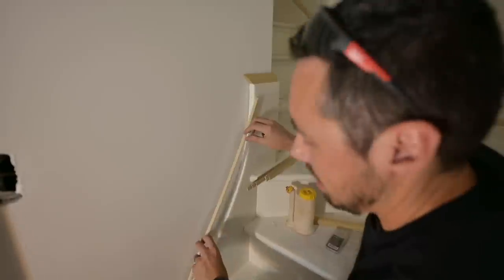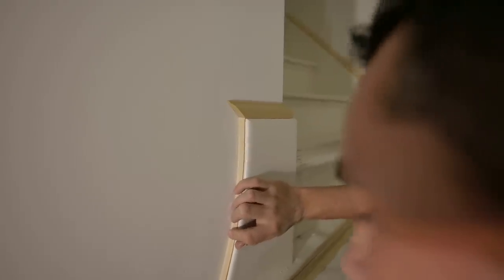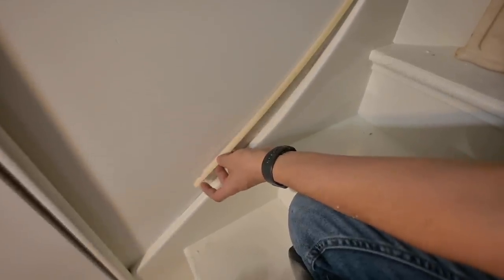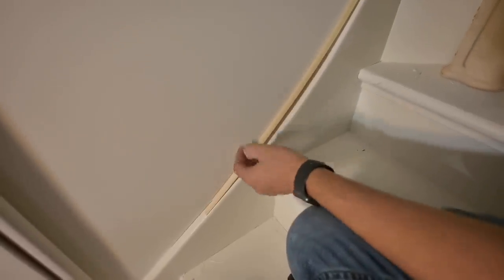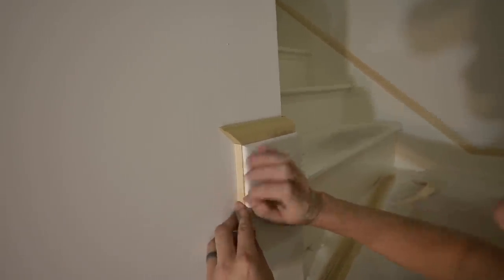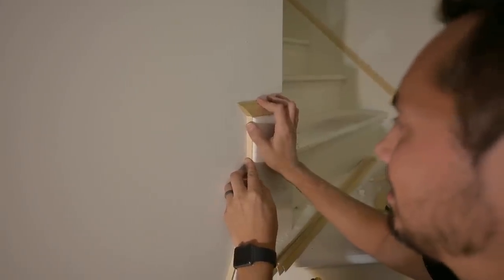I'm going to keep these in order, get the glue and pin nailer, and line up that 45 — these already have that outside 45 on all of them. We'll line them up on that pencil line and get these installed. I've got my pieces laid out right here, still in order. Taking this first one and starting to flex it into place — look at that, it bends in there so easy. We're well past our straight pencil line. I can see some tear-out from the table saw, which is why I made these extra long. This is going to work out like a charm.